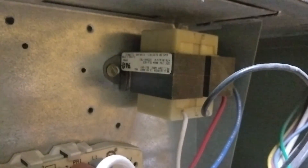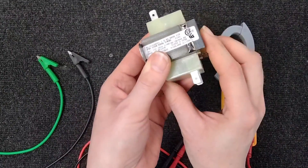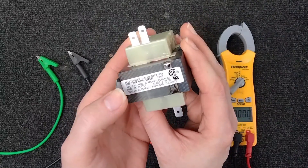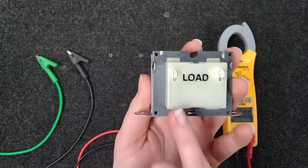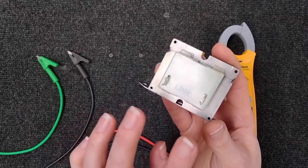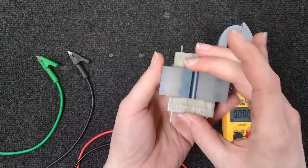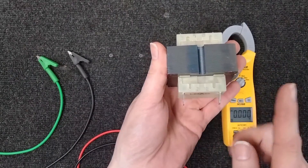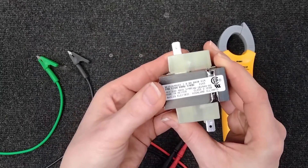This is what's known as a step-down transformer — a residential step-down transformer. So how can you tell if your transformer is bad? Today we are taking a look at the step-down transformer. This one is going to be going from 120 volts on your line down to your 24 volts, which is your load. In the simplest terms possible, what it's doing is taking your high voltage and stepping it down, which means it's transferring the energy via this electromagnetic core to 24 volts. We'll get into the science of that later, but essentially that is what it does.